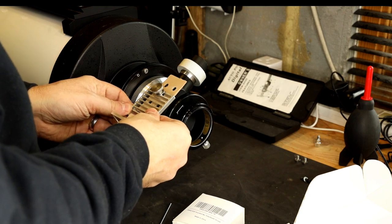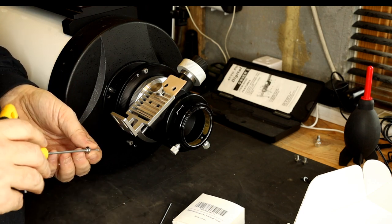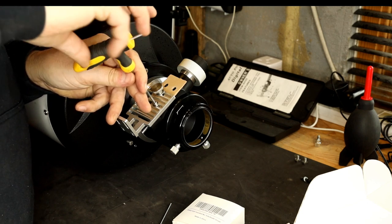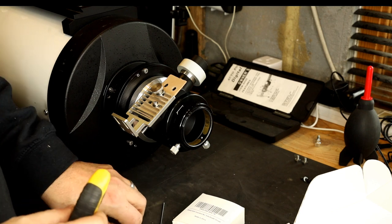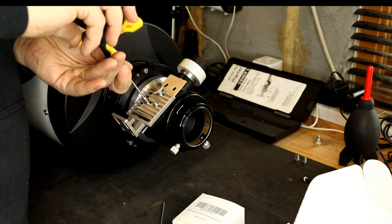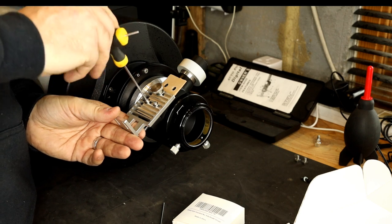So the next job is to take the 20mm M3 bolts, just make sure I've got the right Allen key, and these are now going to go into these mounting slots. Make sure you've got a washer on there so you've got a nice even bit of pressure. I think the head of the bolt would actually bite on the mount, but I would definitely suggest a washer to give you a really good bit of purchase there, and it'll mount properly.